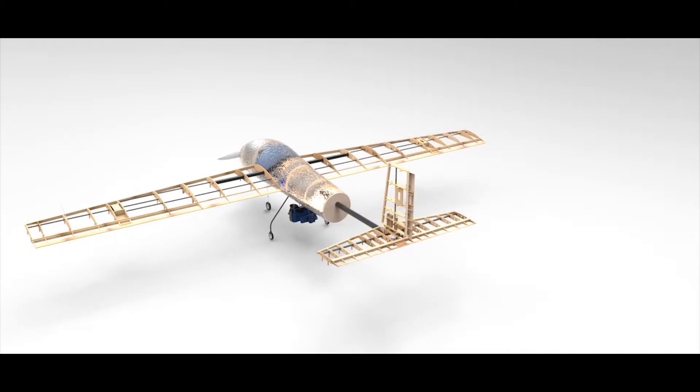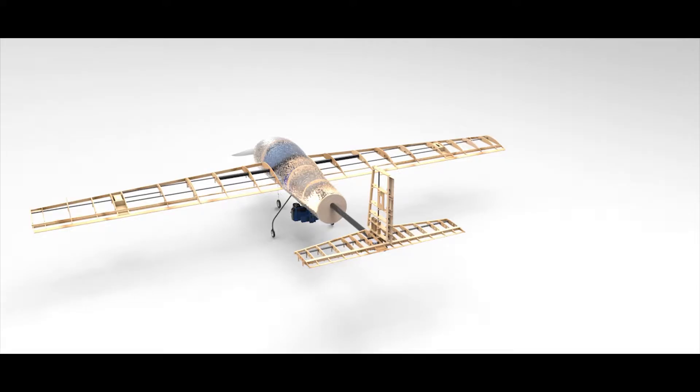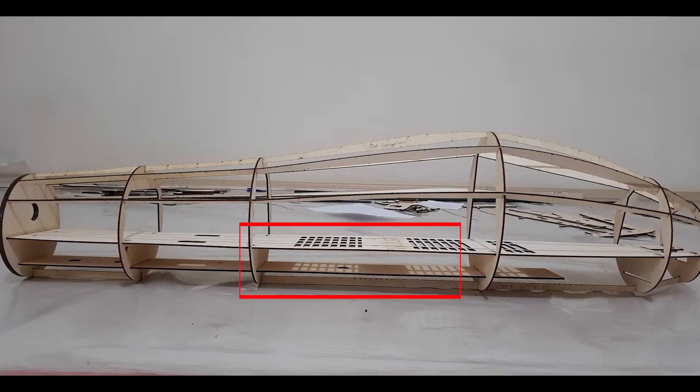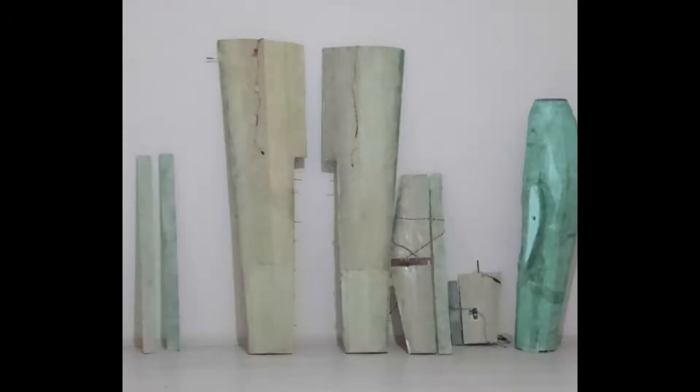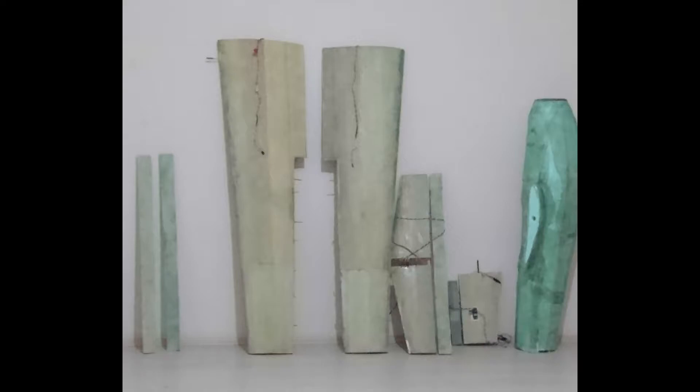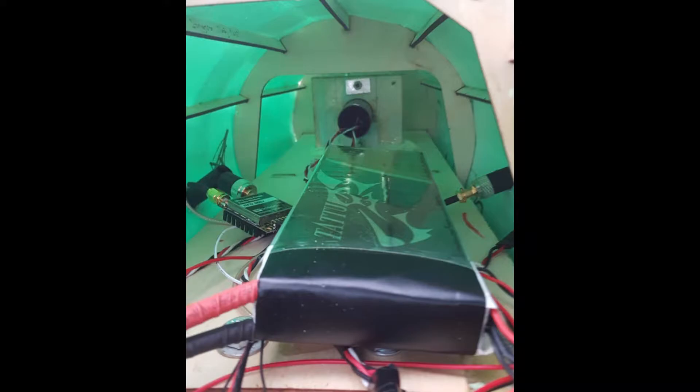The same methodology is used in the tail design. The conventional tail is connected to the fuselage with a 30 mm carbon fiber pipe. There are two main plates inside the fuselage made of birch wood, which help with stability and hold the electronic devices in place. The surfaces are covered with fiberglass sheet to achieve a smooth, fine structure. The main power supply for the avionics system is a 9000 mAh 4S battery placed in the fuselage, and for the brushless motor, a 16000 mAh 6S battery is placed at the front behind the main motor.